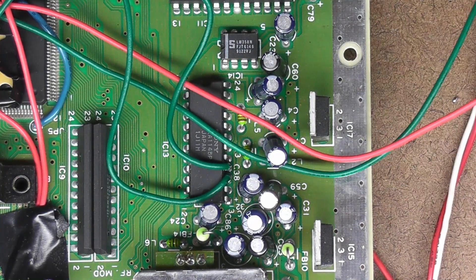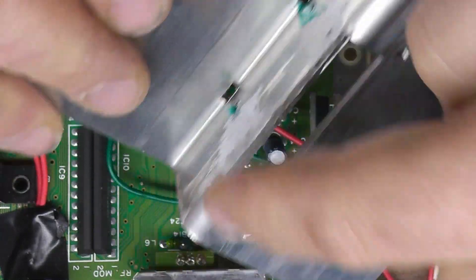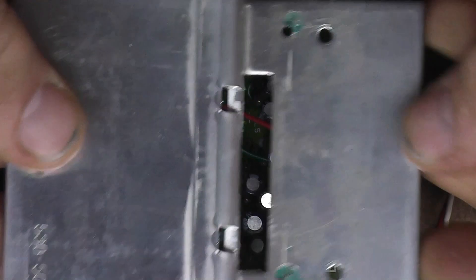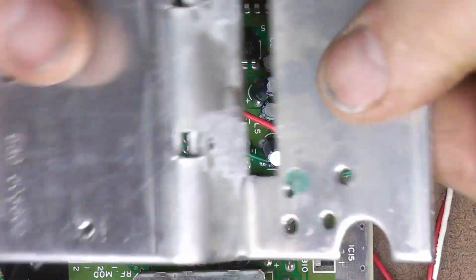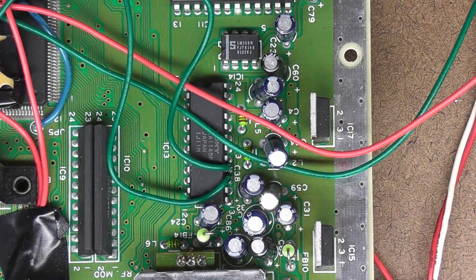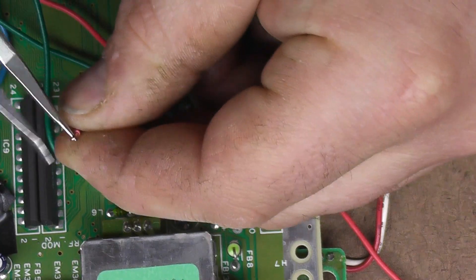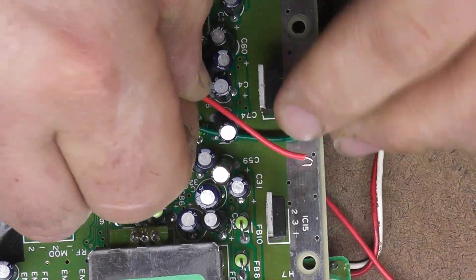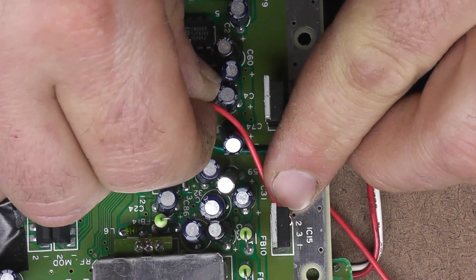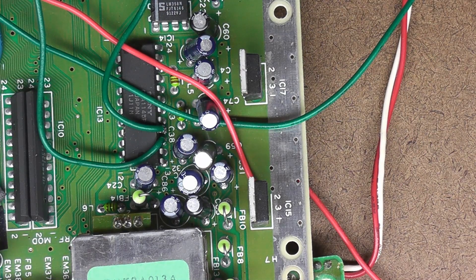You want to come in between the wires, between them, because when the heat sink slides on these two sides touch. So you want to come in the middle where this gap is, otherwise you're not going to be able to get the wires in there. I'm just bending a tiny little hook in there to make it easier, and I can hook that leg right there and solder it in place. So the board power is all connected.